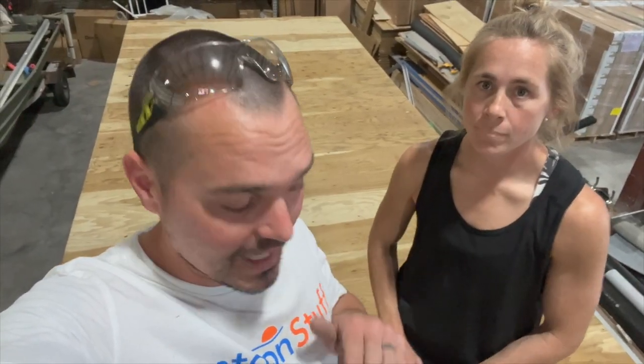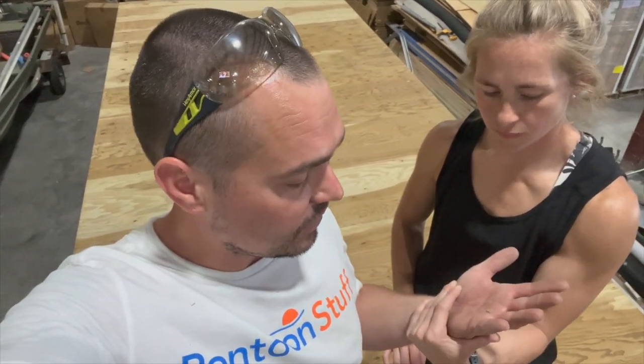And just like that, it's fully decked. We'll use self-tappers to fasten it down and show you that process. Then the vinyl goes on — this is getting the woven vinyl teak plank from pontoonstuff.com. It's 8.5 feet wide by 4 feet — it's an 8.5-foot-wide boat, so that's why I was confused. The plywood has a sanded, void-free side — if there are knots, they're filled in. We only had to rip down three boards and there were three that were full-size, so we actually lucked out. Moving on to flooring next.